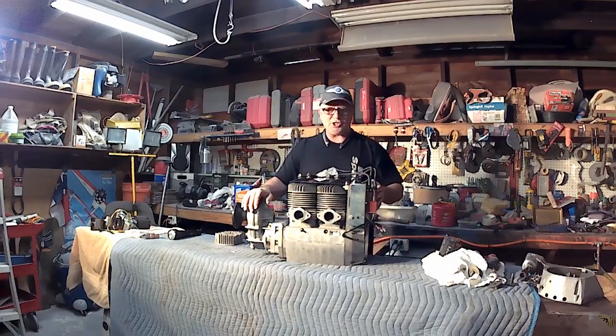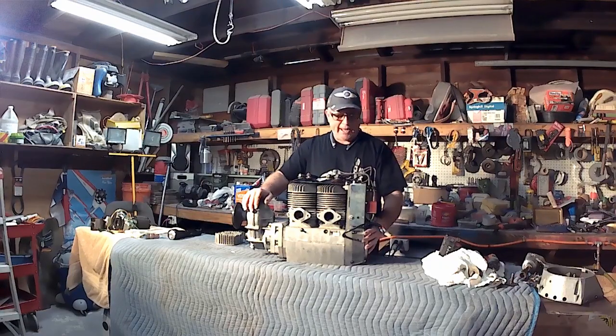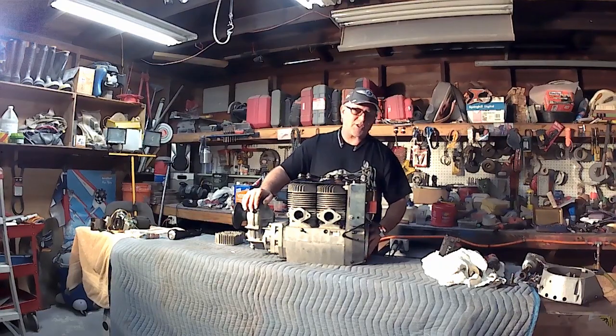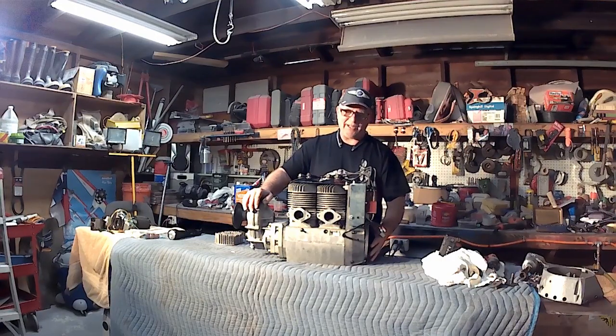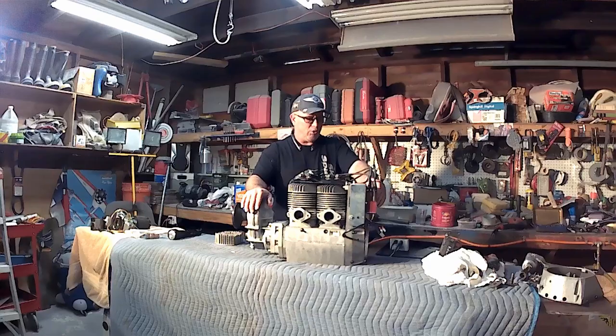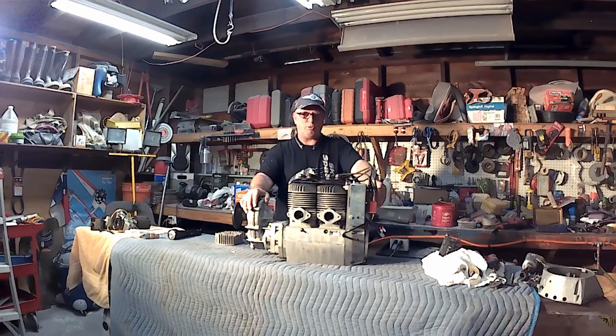He also additionally double-checked the timing on this engine, and he said it looks peculiar when he was noticing that that little screw was kind of all the way to one side. It didn't look like what it should have. So he wanted to go ahead and double check the timing, and he did that. And just as he expected, the timing turned out to be 10 degrees retarded.